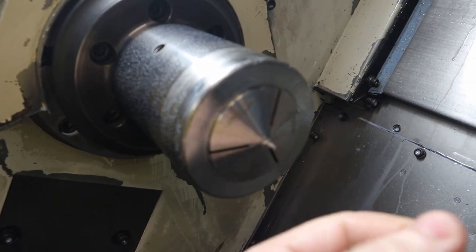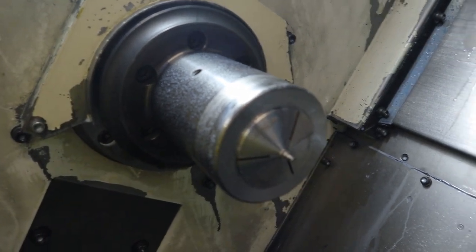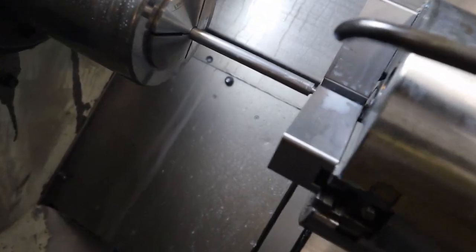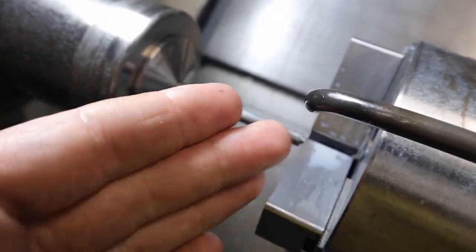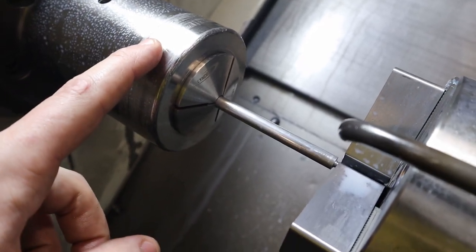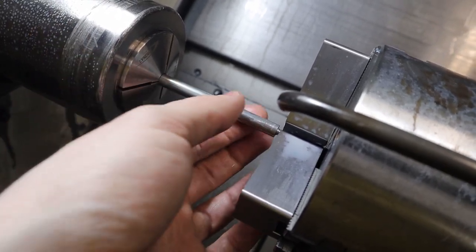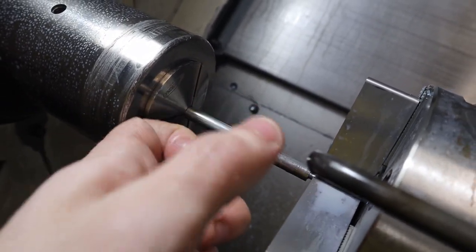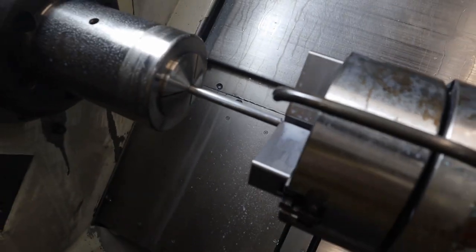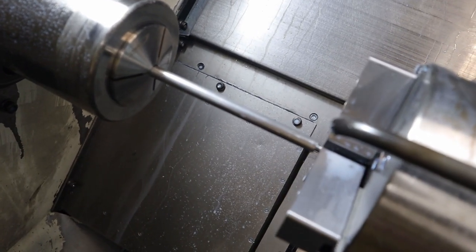Currently, it is a settable thing, so we are able to program its position if we need to. So now, finally, I'm going to mess with these two and see if I can get them to play nice with each other. Okay, so I brought the sub-spindle forward, in orientation 0, and so this is 0, and then this is C0, and actually they did line up, like I said yesterday, but now that the jaws are actually in place, it really lined up. So I went ahead and took the risky plunge, and I clamped the sub while the main was clamped, and then I unclamped the main, and I'm pulling it out with the sub, as you can see, and it looks like it still lines up, so that's a really, really good sign.